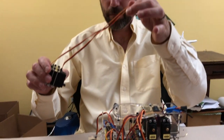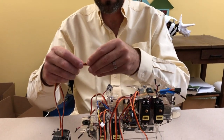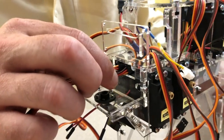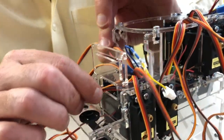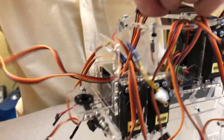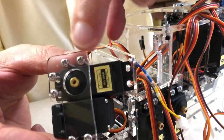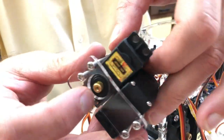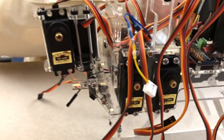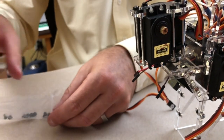The first thing I'm going to do is run these wires for the neck and head. I'm going to run them through this hole in the front and then underneath the plate, then come up the hole in the center along with the other motors. Those come up through the center and then the motor that's coming through the plastic hole there gets mounted down. I'm going to go ahead and screw that motor in so it doesn't come off again. I've got the mounting screws I set aside from all of the motors — when I first unpackaged them I took all their mounting screws out.